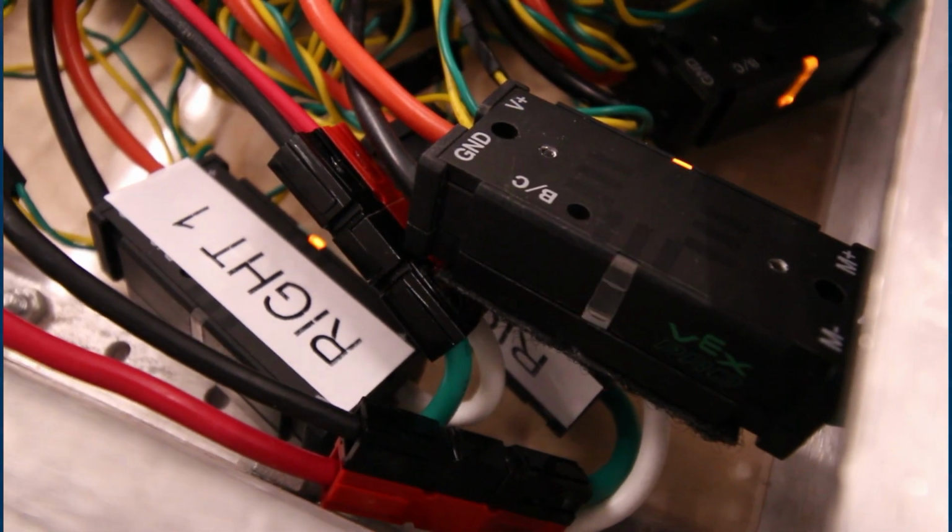From a controls perspective, our first priority was to get a simple drive base running so that programming could get a head start on some basic commands needed for driving, and specifically to this year, climbing on the charging station. We did this with 4 Victor SPXs and 4 CIM motors.